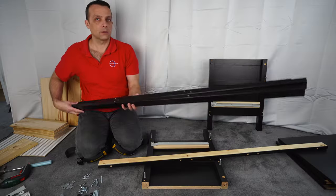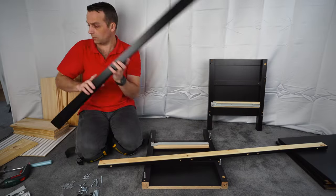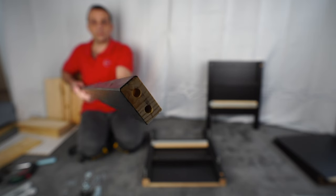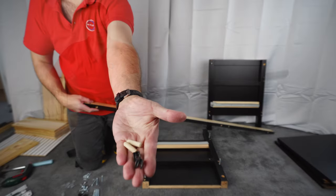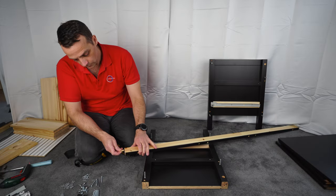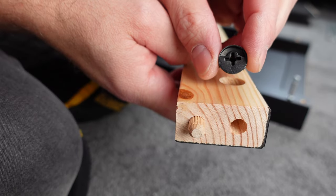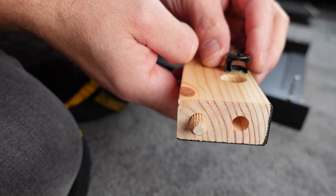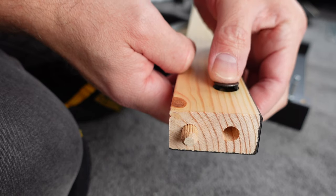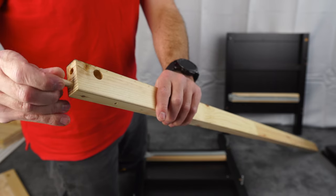You're going to have three identical long panels with a gap at the back, and one without a gap at the back. You're going to need two wooden plugs and two metal locks. Place the wooden plugs on the side and the metal locks with the arrow pointing to the front hole. If you point the arrow the other way you won't be able to lock the unit. Do exactly the same on the other side.